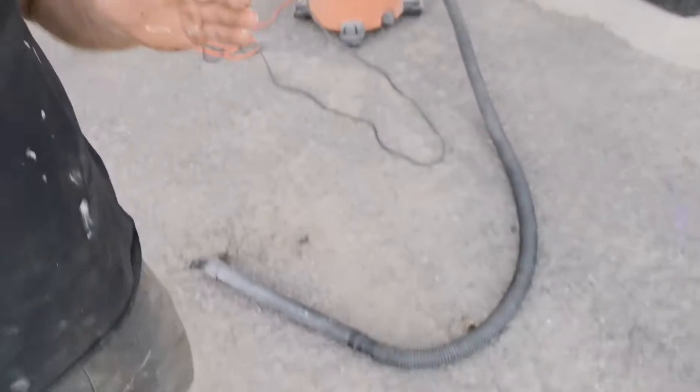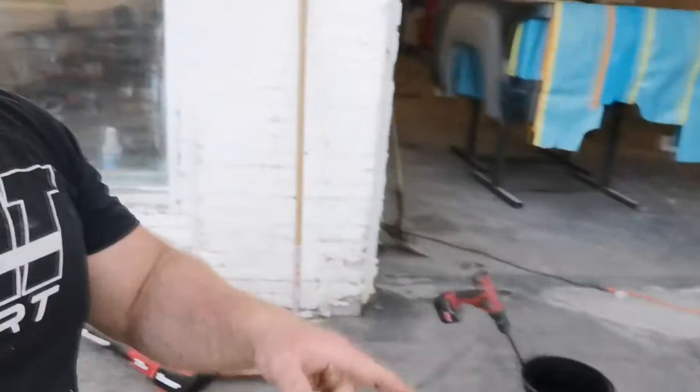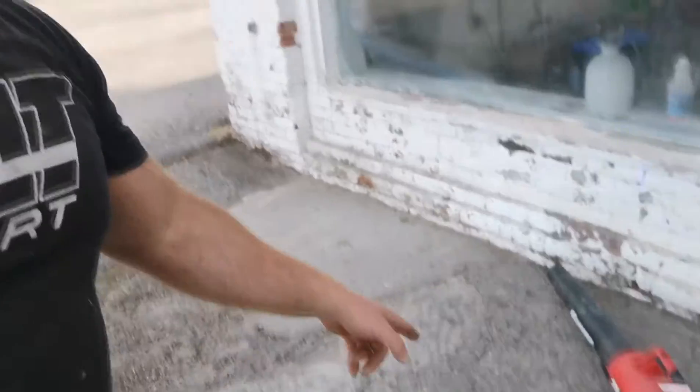A few things you're gonna need before you tackle a job like this yourself. You're gonna need a good shop vac — if your driveway is as worn as mine, you'll have loose gravel and debris everywhere, plus dirt inside all those little cracks. You've got to vacuum them up. Simply brooming them out doesn't cut it, and a blower helps too. I'd use the vacuum and come right behind it with the blower — between the two, you'll get about 80% of it. You're not gonna get every speck of dirt out; it's literally impossible.